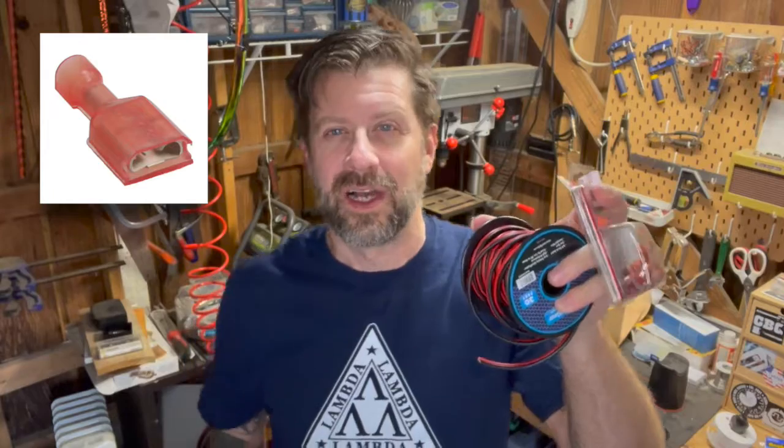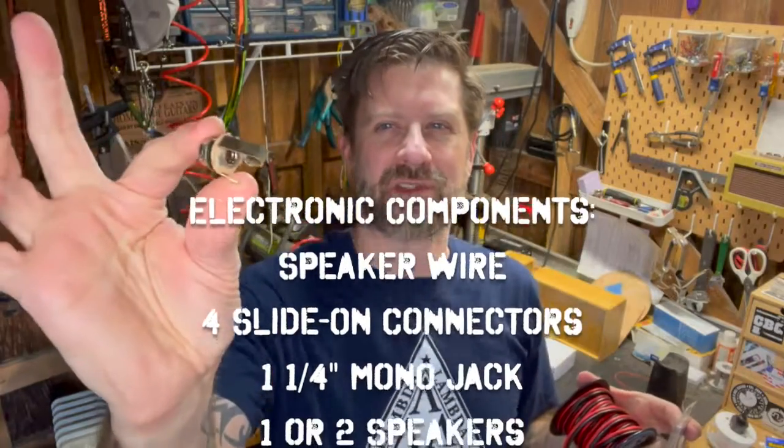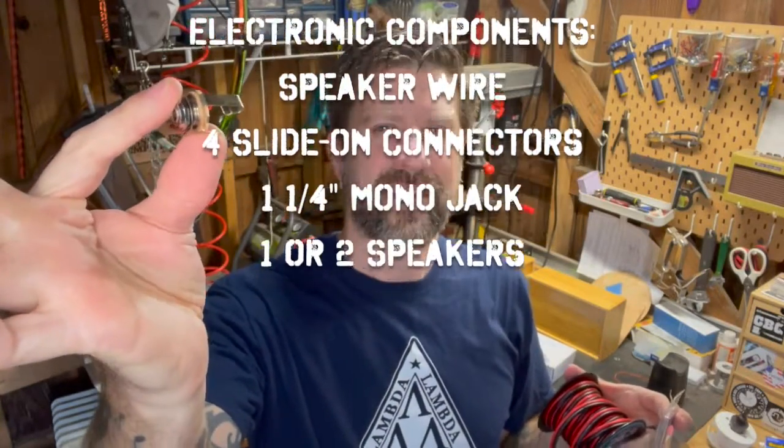Okay, now for your electronics, the first thing you're gonna need is some speaker wire. I've got a roll here, but just basically any speaker wire will do. And then you're gonna need some of these little slide-on crimp connectors. If you didn't wanna use these, you could solder them, but I'm not crazy about the idea of soldering on speakers, more about that later. And then you're gonna need just a straight up quarter inch mono jack, nothing special there.